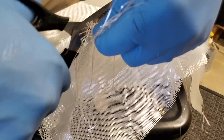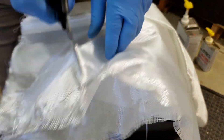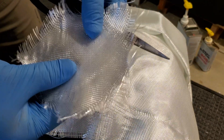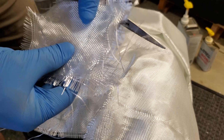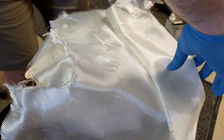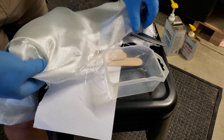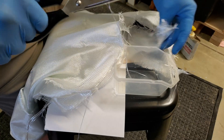I don't need patches that are too huge but big enough to fix the issue and adhere to the door. I'll use both the knife and scissors. I want to get about two or three layers — probably four pieces — so when we put it up there it strengthens itself pretty well. I've got enough pieces; I did three but I'll cut a fourth just in case, because once your epoxy is made you don't want to be cutting more fabric with gooey hands.